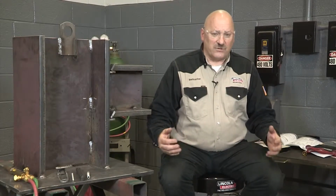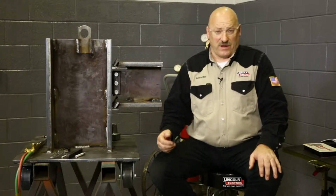Make sure we have our proper safety gear on, flame retardant clothing. Make sure the pants aren't frayed, your jeans, if you're wearing jeans, are not frayed. Gloves, proper safety glasses. Refer to manufacturer's guidelines for proper torch setup and application. Make sure we have the correct check valves on the torch, flash arresters back at the regulator, hoses are in good condition, regulators are set and operated properly.